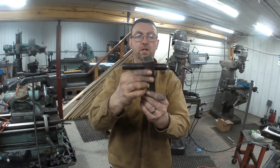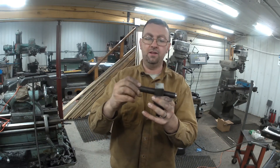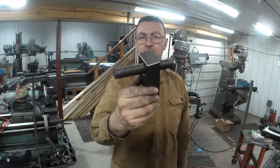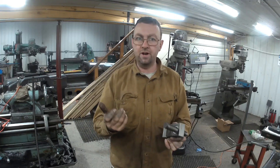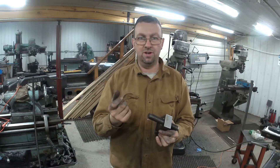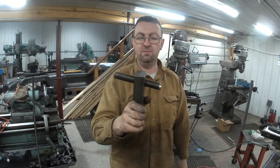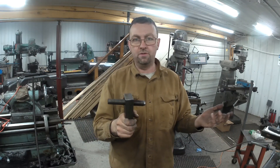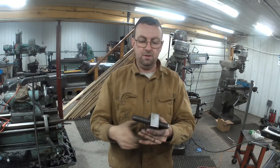There you have it - all done, except I'm going to weld a nut onto the end of the threaded rod so we've got something to put the wrench on. Pretty simple, basic tool - you can make one yourself. Just measure out your T-slot and make them a fairly close fit, because you don't want them loose so they rock. My old ones were just three-quarter inch stock and they cocked back some - it worked but wasn't great. These are going to give me a lot more height and more adjustment, and they'll work on the horizontal boring mill as well since it's the same T-slot size.